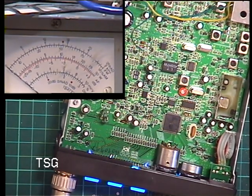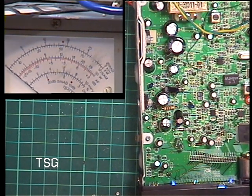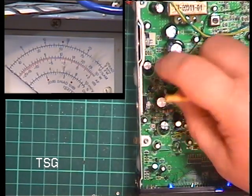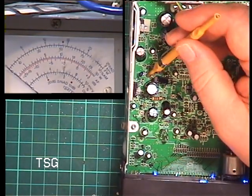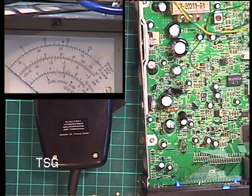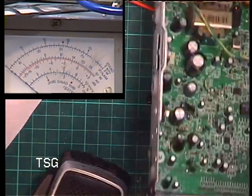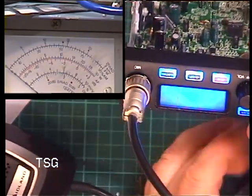Now, AM modulation, we're going to have to reprogram the set to do this. But AM modulation is RV201. And RV201 is just down there. So I'm just going to have to program the set for a European set of channels. So I'll just pause the video while I do that. So we're now in E mode, and we're now in, so it's E country and AM.